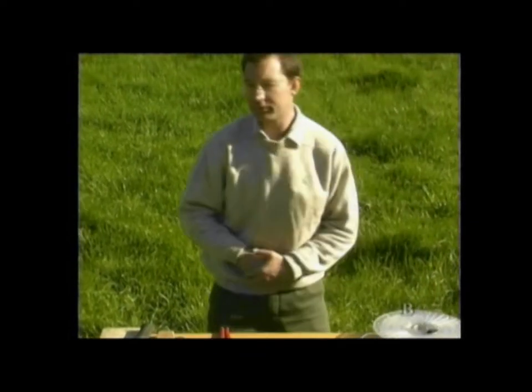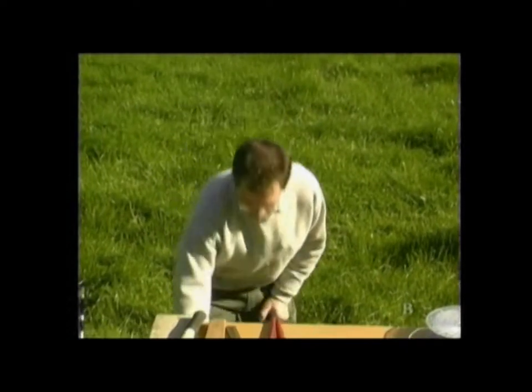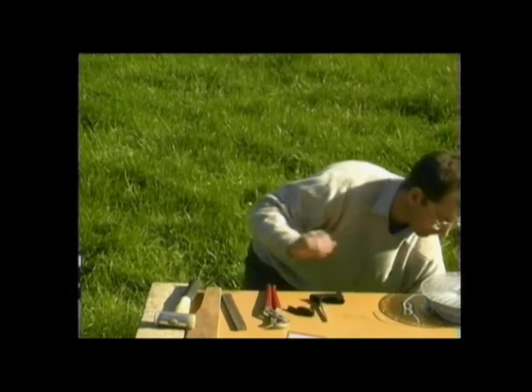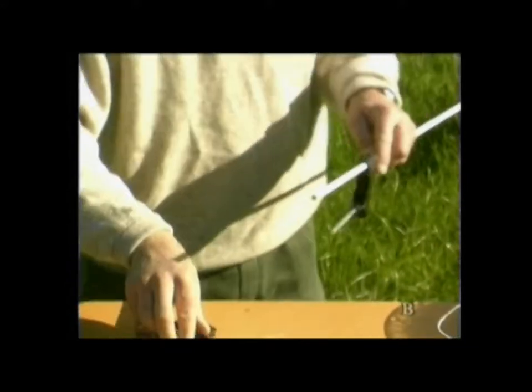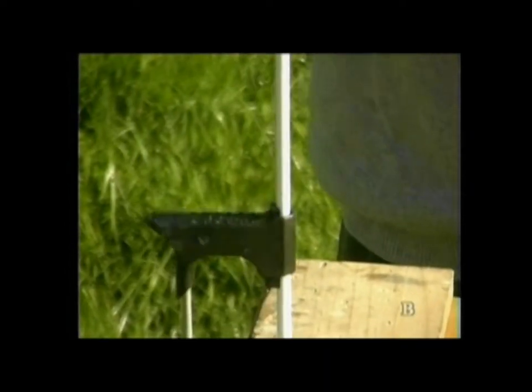The 18 tread-ins used with the beef pack fence kit are exactly the same as for the dairy pack system, but I'll just quickly put one together for you to remind you of how it goes. Thread the pedal on, align the thick end of the wedge with the red mark, press the pedal down, and tap it home.